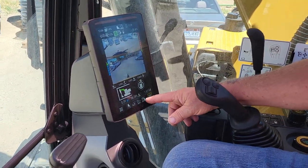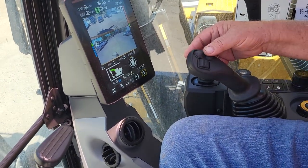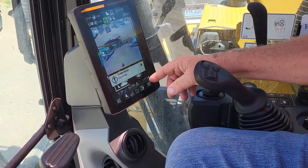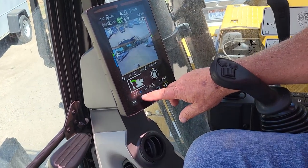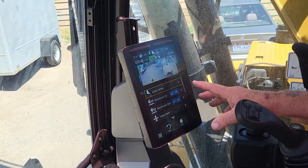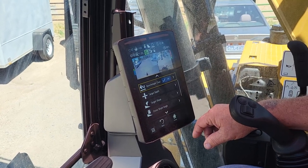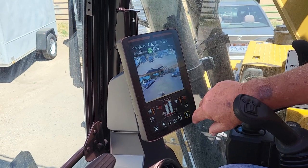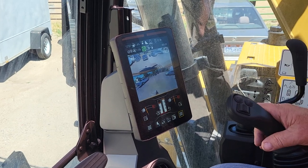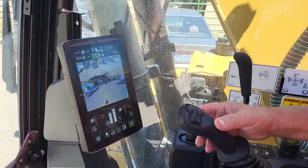So that's auto dig and grade control. Now I'm going to get back into this monitor, turn off auto dig, and go back into grade. If I want to get clear out of everything, I've already zeroed out target depth and target slope — all I've got to do is hit clear benchmark, apply, go home, and swipe that across. Now it's just a normal excavator — just digging.